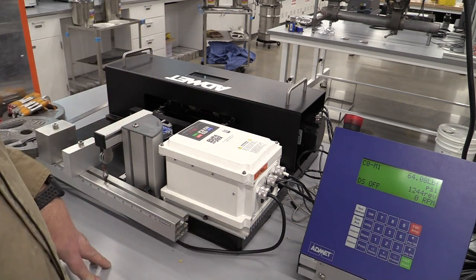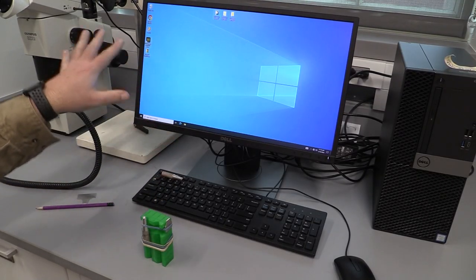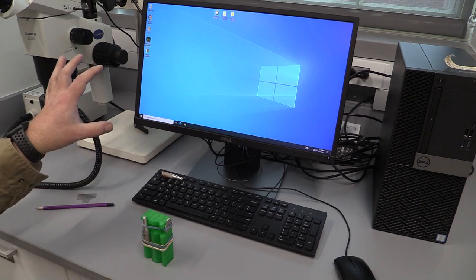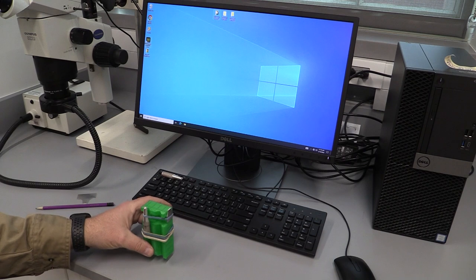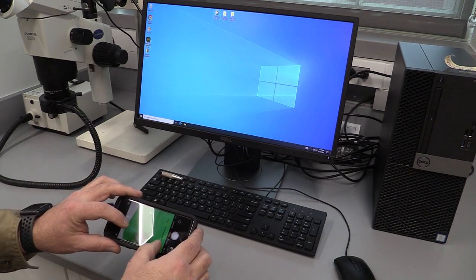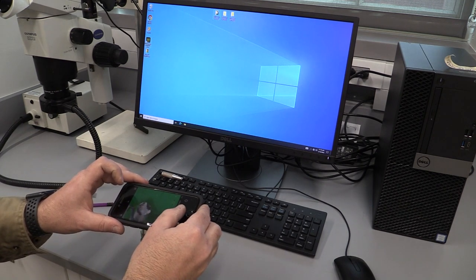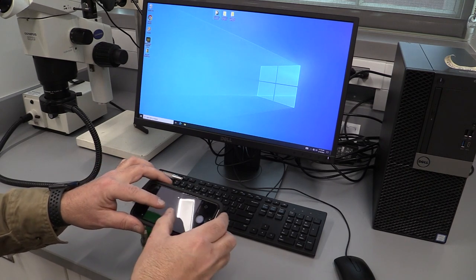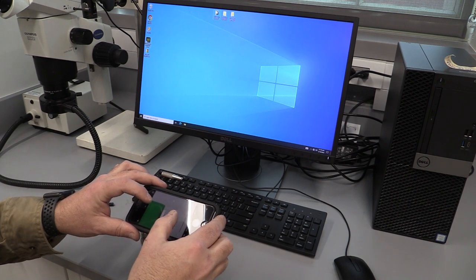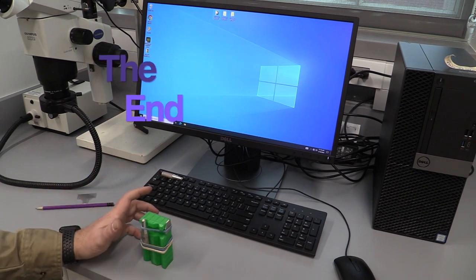After the break, remove the guard and remove the sample, then record the revolutions at which it broke. We're at the zoom microscope — we normally take images of the fractured surfaces here, but some surfaces are so irregular in height and valleys that focus doesn't maintain well. What you may want to do is mount the samples in the fixture, then use your phone to zoom in and take a focused picture of the failure. I've got both broken specimens illuminated and well-focused so you can clearly examine the fractured surfaces.